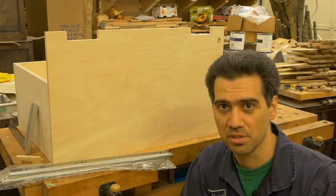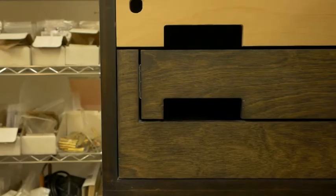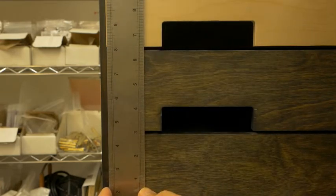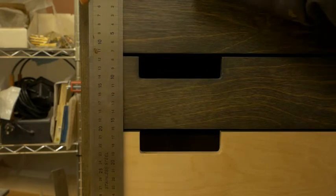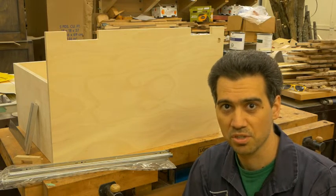Even though the cabinets and the drawers are done using the exact same measurements, there are always going to be some minor variances that happen during the making. So in this example, as you can see, when we align my square straight edge, we can see that I do need to take minor material off the side of this particular cabinet, whereas the one below, it's all aligning perfectly. So if I have them branded, then I wouldn't be confused as to where each drawer goes when I take them out for either transportation or cleaning.